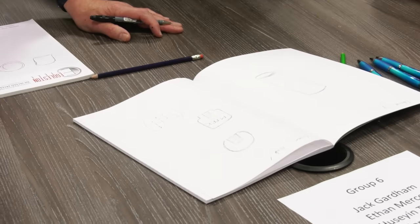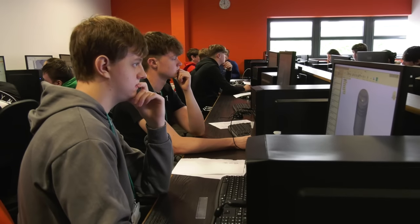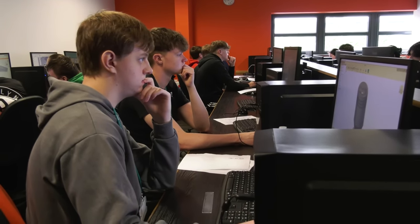As a team we've come up with innovative gear sticks that can be replaced by different components. We'll manufacture everything in-house as much as possible to reduce cost and increase profit, and the top is also interchangeable so we can sell that as an option. As the company grows we can go into different products as well — dashboards, car seats. Because it's an oval shape, we'll draw it in the CNC and we'll have to flip it over halfway through to machine the other side and then create the thread on that side. People can request a custom gear stick, but we can also make generic ones that can be mass produced for any customers. I just want to say how much you've thought about this — it's incredible, honestly, such a powerful pitch.